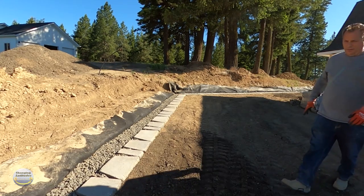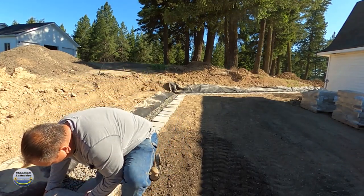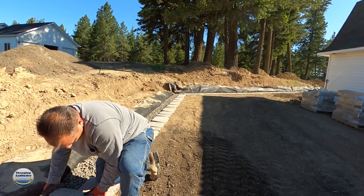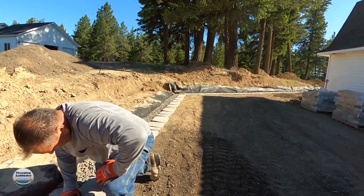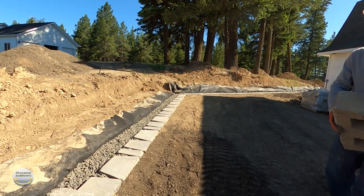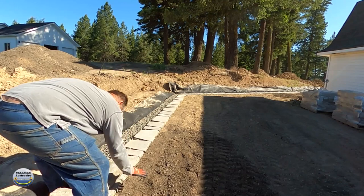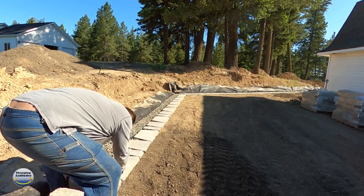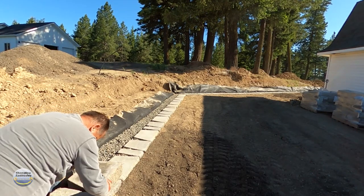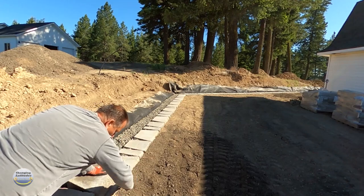I purchased these bricks from Belgard. This is the Victorian blend. It is a very attractive retaining wall block. Of course, in the manufacturing process, there are always these hanging chads or dimples or extra pieces of cement that you have to chip off. I didn't do that in the first layer that I put down above ground, and came to pay the price for that down the road. You have to remove those extra bumps, because if you don't, it throws your wall offline a bit. So all that perfect work you did to place the bricks into the ground originally would come offline, and I had to rework that to make sure the wall was correctly built.